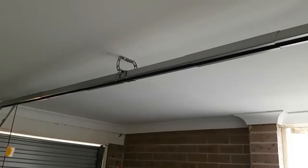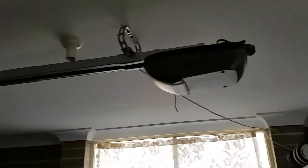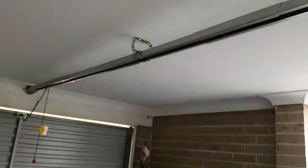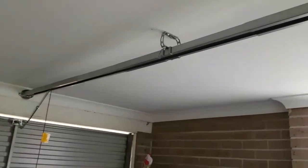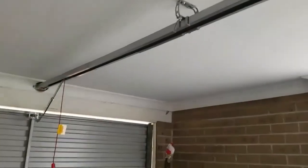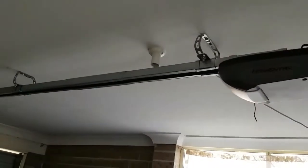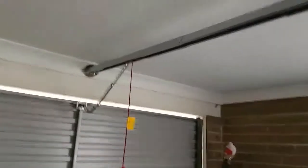My ceiling had a lack of studs in this garage — there's a stud only in the center of the beam, right along with the eaves. So I had to restrict myself to sticking to the center of that line. Otherwise you could make a U-shaped clamp for a little more support, but it is solid — it's screwed into the solid timber on the stud above, so it's not going to move anytime soon.